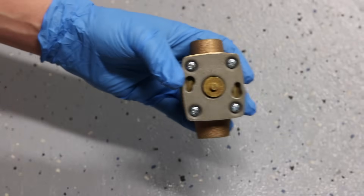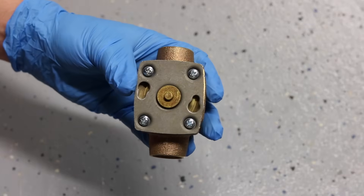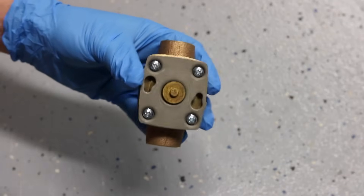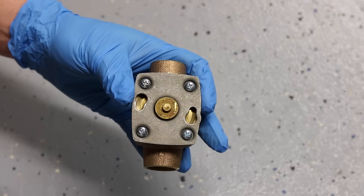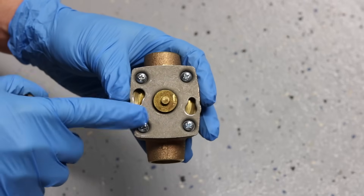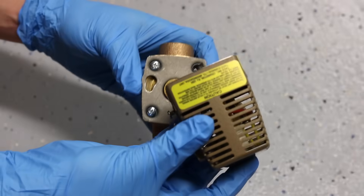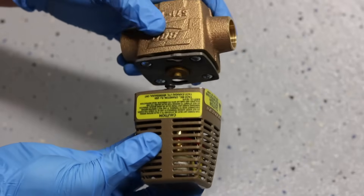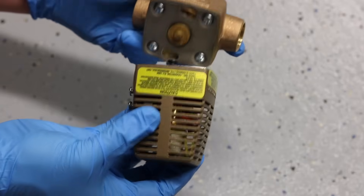Time for a super close-up. I thought this was important, because on the camera you can't really see what I'm doing underneath the valve. This is the base of the valve, and you'll see this when you buy your new one at the store. You can see that those holes have little keyways. When you put your bolt in there from the valve head, it presses into the larger part of the hole, and then when you give it that twist, it locks into the smaller part. That's what keeps it in place, and you can see how those bolt holes stick out a little bit on the head.